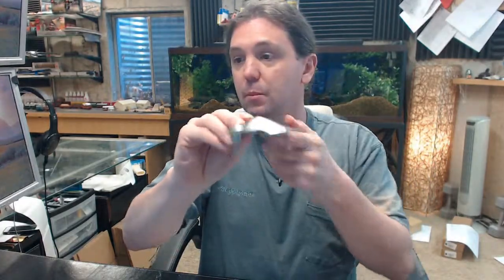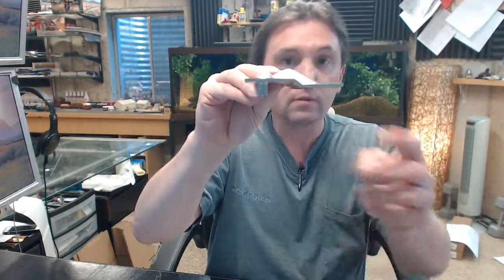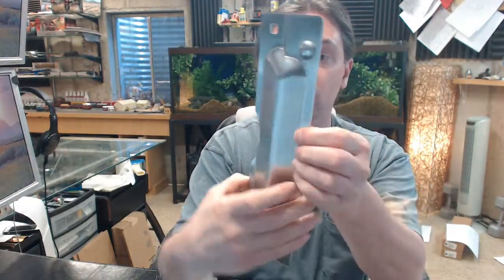That offset is there to account for the fact that when you stand on the pull side of a door, this is outswing, so you'd only install this on the pull side. When you run your hand over the face of the door in the frame, you'll note that the door is inset in ever so slightly, generally about 3/32 of an inch. So it's quite minor, but the truth of the matter is you have to have an offset in the latch guard to account for that. So that offset is there for that. This entire recessed area that you see here is to obviously accommodate the lip of a strike plate. Okay, and that's going to work with all standard sort of strikes, 4 7/8 strikes if you're installing this on a hollow metal door and frame.